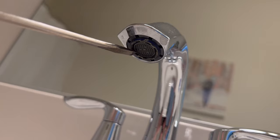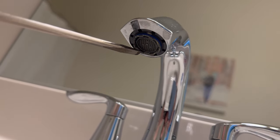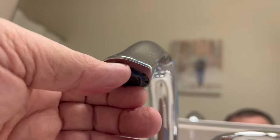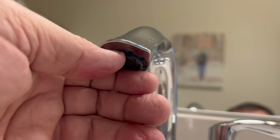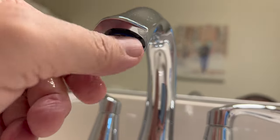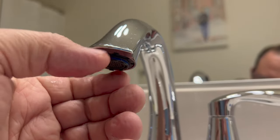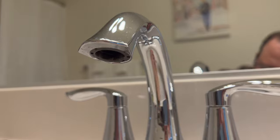There is an issue that comes into play — this little O-ring. See the blue O-ring right here? When I went to put it back on my other faucets, that O-ring started to bind up because I was putting too much pressure on one side. It would bind up when I was screwing it in and actually came off and looped on the outside. This is the third faucet I've done this to. There we go, it should come out now — all right.